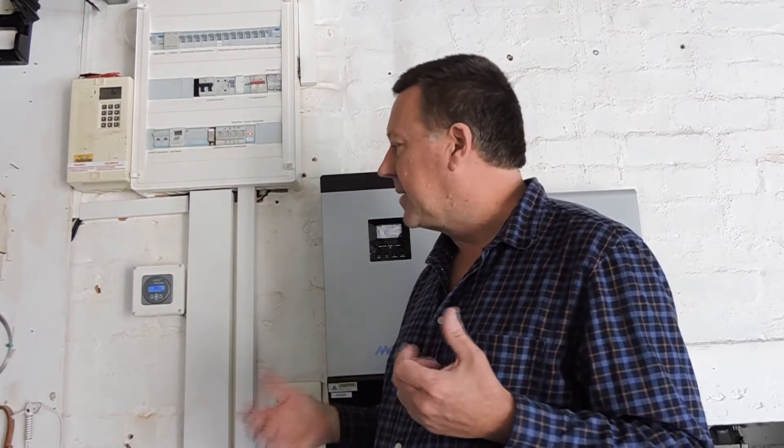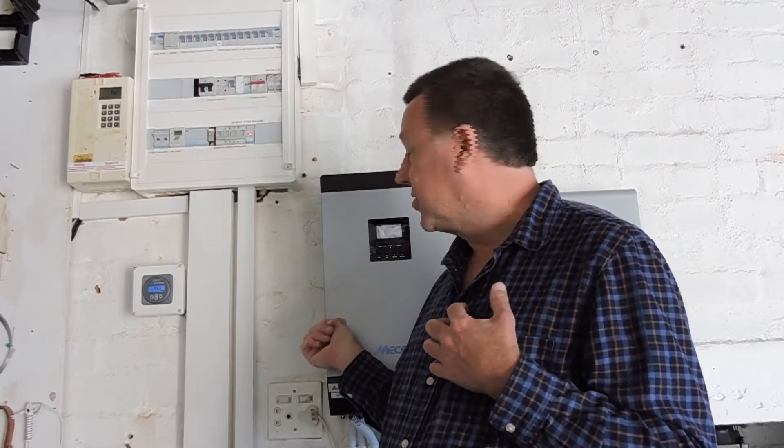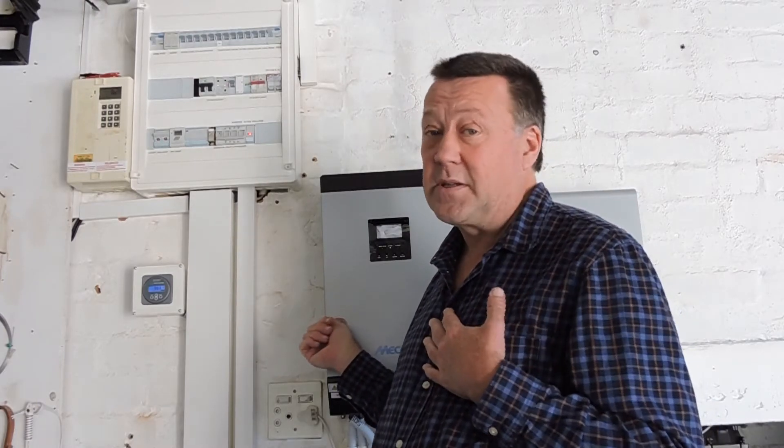With the lithium battery I collect and charge the battery during the course of the day and then use it overnight to run my loads. As I mentioned, these inverters are quite inefficient — the Victron replacing this is down to 11 watts, whereas these draw 250 watts each. So I now have a completely different amount of energy stored that I can reuse, and hopefully that will have a 10 to 20 year lifespan as opposed to 3 or 4 years. No complaints — the system paid for itself. We've had a lot of load shedding here in South Africa, which is when the utility cannot provide enough electricity.